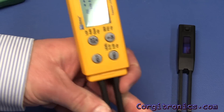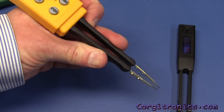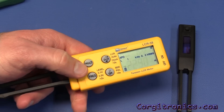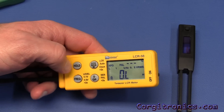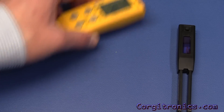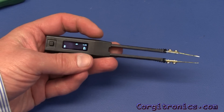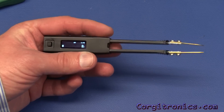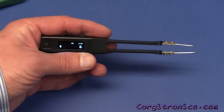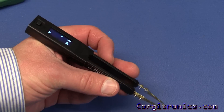The mid-range device at around $100 — is it worth it? Maybe not. It's not ergonomic; they put a small bulge in the back for batteries, and the tweezers are hard to press, so you wouldn't want to place components with it. It is accurate and does the usual LCR functions well, and it's okay on diodes, but it doesn't do everything. Then at the top of the line, the ST5S — it does it all, except LEDs. It's very light and you won't get tired holding it for an hour while placing components.